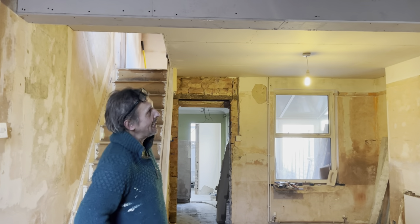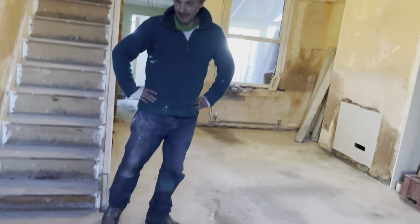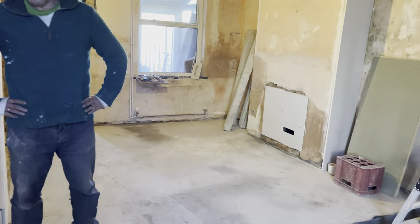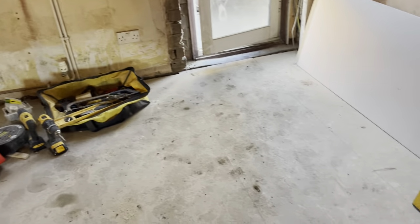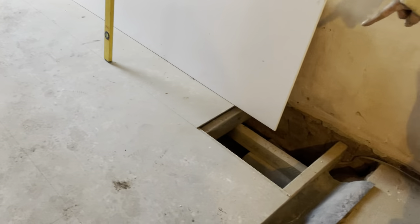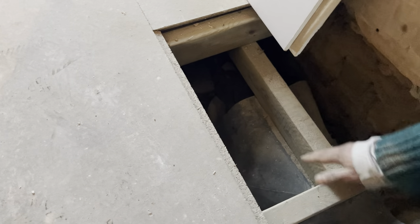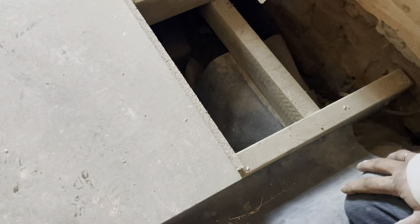He's very good at DIY! Mike, what about the floor? The floor was a disaster — it had collapsed completely. The joists, if you could call them joists, were totally rotten. What you can see here is I built up new columns all the way around, put in the cross members, and installed a new subframe. They're columns holding up the main beams, not so much foundations.